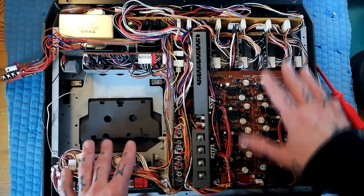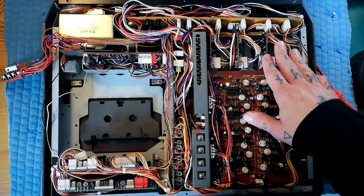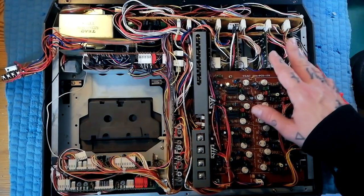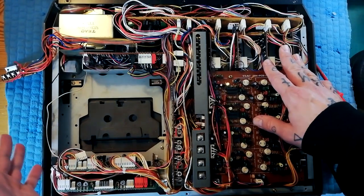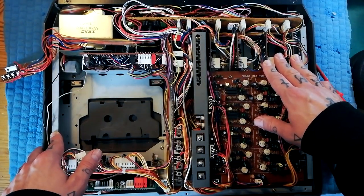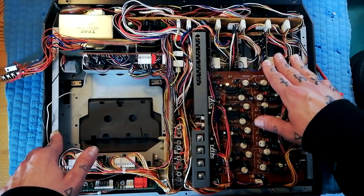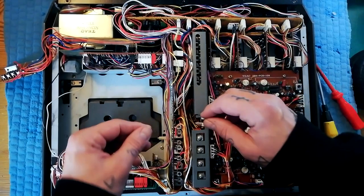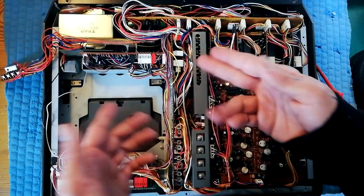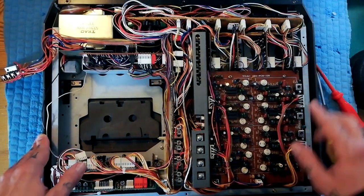Because I've already made a video demonstrating how I clean these mixer strips and also one on how I clean the mixer on a Tascam 424 Mark III, and the process of actually cleaning it is identical — I put some contact cleaner through it, blow that through with compressed air, apply some lubricant, and agitate the pots and switches a little bit to make sure that lubricant spreads across. I'll put links to those videos in the description of this one.